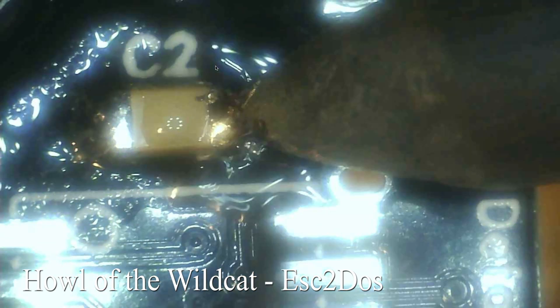Soldering these 1206 capacitors takes a bit of patience, but there's only two per board so it goes pretty quick. I'm using the smallest tip that I have, but I'm doing it on an angle, and that really makes it easy to bridge between the two legs. This isn't the same as soldering through-hole components — the way the solder wicks underneath to catch those pads gives kind of odd results, so you really have to get into a rhythm.